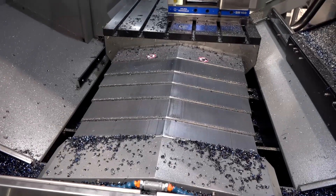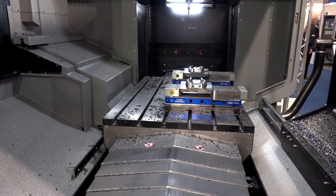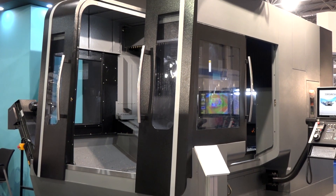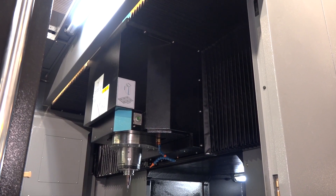We talk about the Y-axis — this machine has 950mm in the Y-axis, that's huge isn't it? That is a lot, and that's why the design of the machine had to change. If you look at it, we've got dual columns on a bridge that allows both ends to be supported. That means wherever you're machining on the table, you've got the same rigidity — the bridge moves and the spindle moves across the top, so that rigidity is key. Exactly, it's all about rigidity and being able to move very quickly.